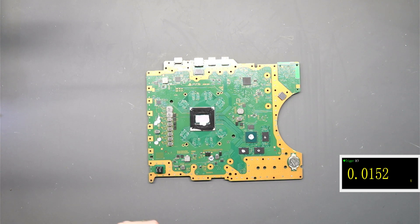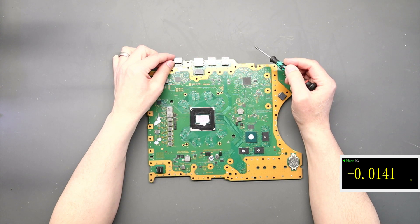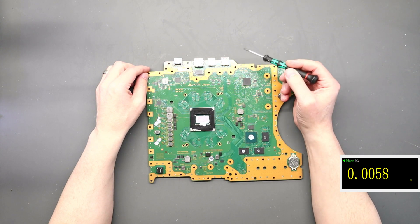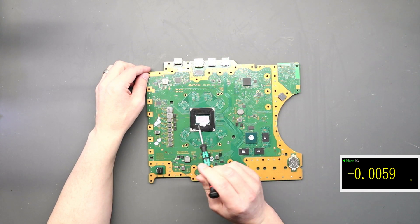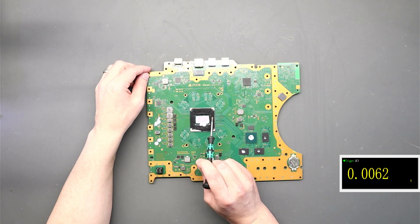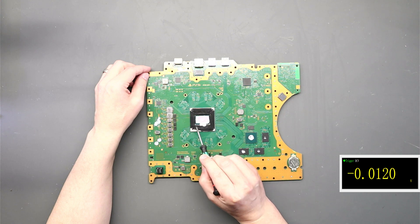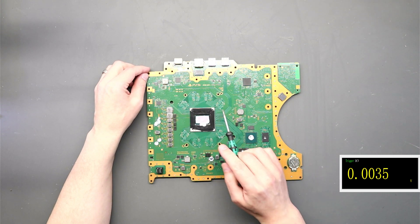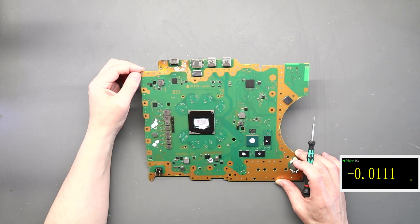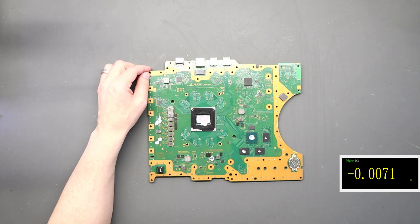With the motherboard out, a couple of things jump out. First, the HDMI port is hardly connected — some pads may be connected but it needs attention. More significantly, there's no liquid metal — someone has put standard thermal paste on there and removed the foam padding from around the APU. Hopefully no liquid metal has spilled underneath the plastic coating or sticker, but we can check that shortly.